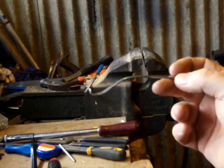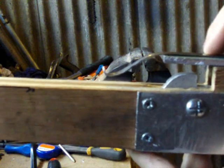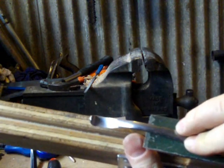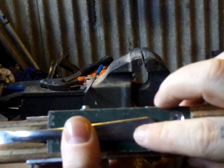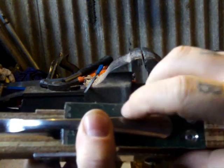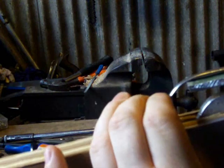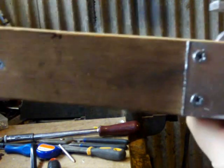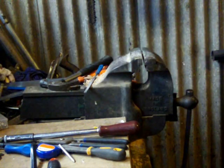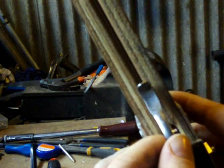Mine will be a bit longer than the one in the diagram at this point but I haven't cut it yet. This sits on like that and holds the bolt down. Given the length and thickness of mine I'm probably going to bolt mine on right back here. You're going to want to drill two holes right the way through the spring and the aluminium — this is to put two little bolts through to hold it down. Make sure the spring is slightly lower, adjusting with your hand. You want it so it's above the groove to hold the bolt down.